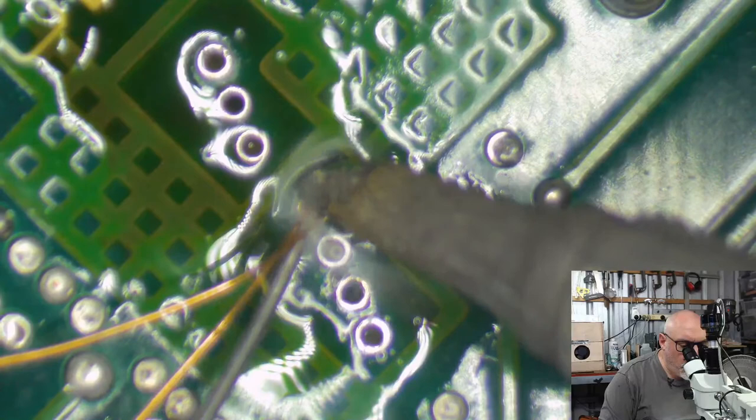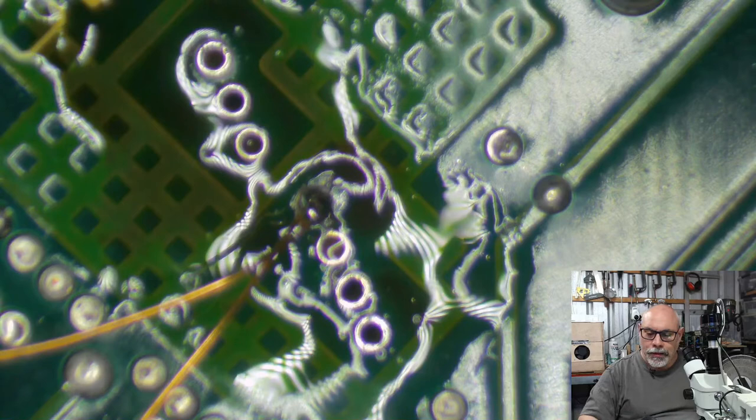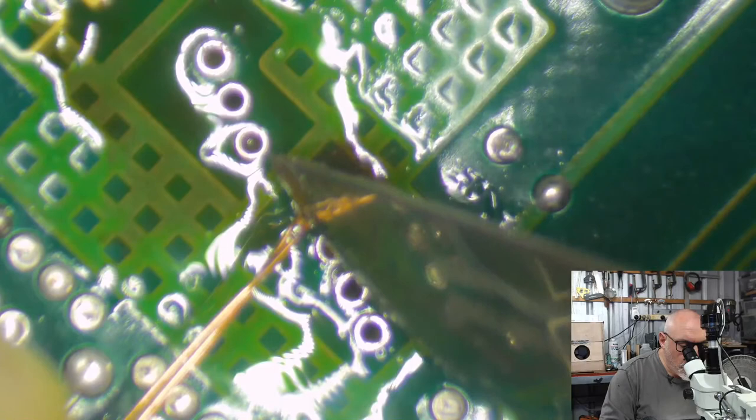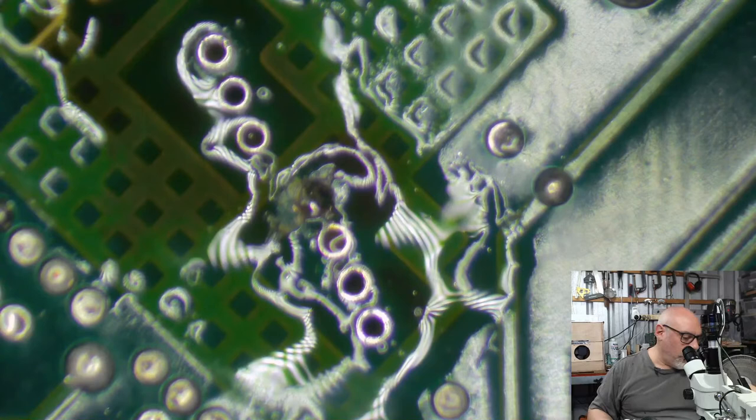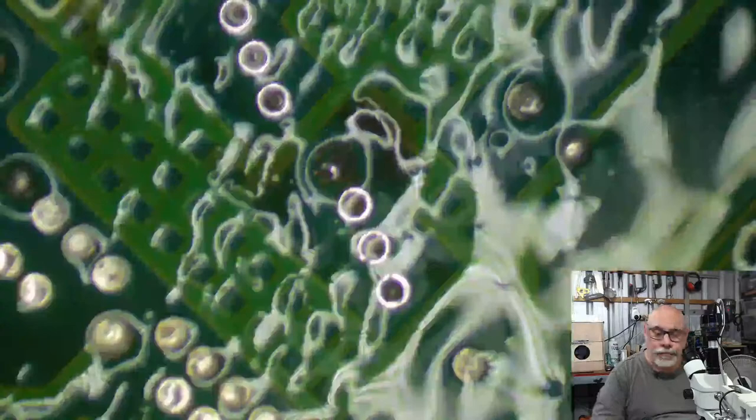putting solder on anything, the three magic ingredients that you need to have are clean surfaces, number one. Plenty of heat, number two, and flux. So generally, if something's not sticking, it's because one of those ingredients is missing. Either your iron is not hot enough, or you are not getting the two things hot. Because here's a really important thing.